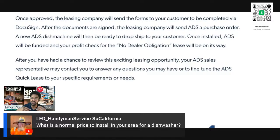Ventilation. Do they have proper ventilation? Do they need to buy ventilation? Do you have to make adjustments to the ventilation they have? Or maybe they're not even going to do that. Maybe they're going to have a reclaim system. Now they have compressors inside these dishwashers, and the compressor will run and condense. It will trap the steam through the coils, turn it back into water, and then use that same water to fill the machine. Those machines use less water, so you're seeing a lot more of them now.